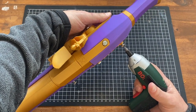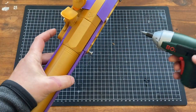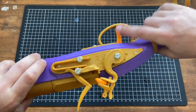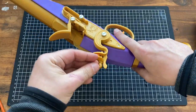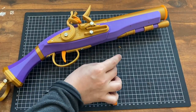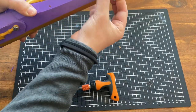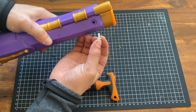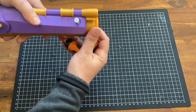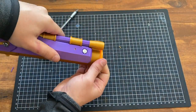Hold that plate down — you should see the screw almost popping out, but not quite. Do the front as well. Now the screws should be flush. Before we finish, there is one last screw: this 10mm screw is going to go in here to make sure this doesn't get popped off if you knock the barrel. Insert that, make sure it's rotated in the right direction, and it won't rotate out — it'll be pretty secure.